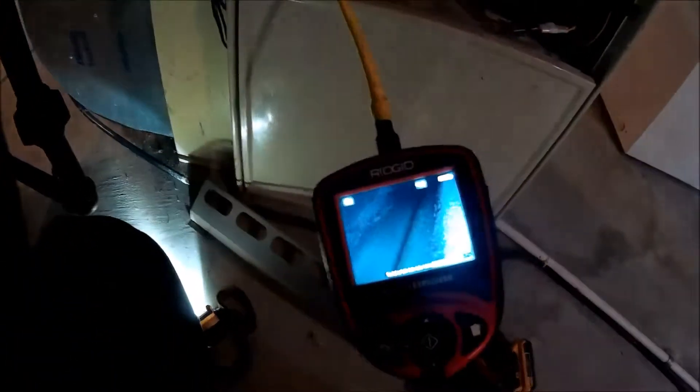What I've found doing the heat exchanger inspection — you can see a big, big crack right in the heat exchanger. It goes all the way up there. You can see that's wide open on the screen. The rest of the heat exchanger looks pretty much okay. Back of it's nice and smooth. This is a 5-cell heat exchanger.